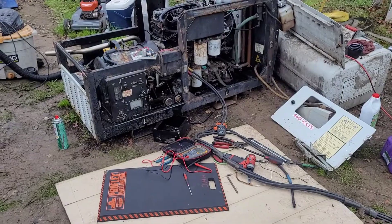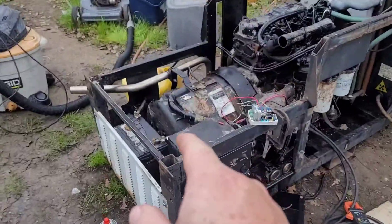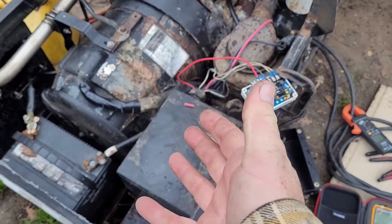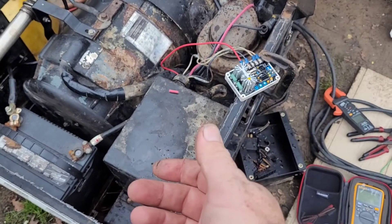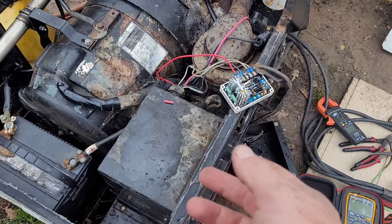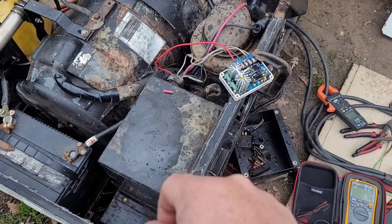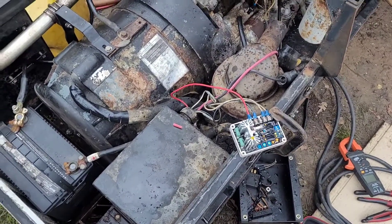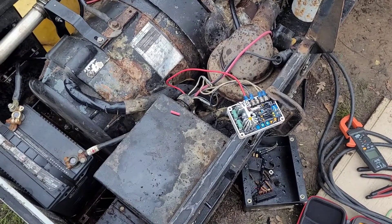It's the following day. Got it restrapped in the box — it's a 12-wire lead alternator. You can find videos on how to do it anywhere. Basically you bond two sets of four wires together, then take two sets of wires for L1 and L2, and strap one of those bundles of four wires for the neutral.